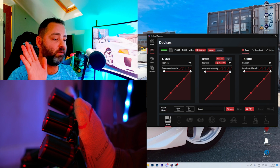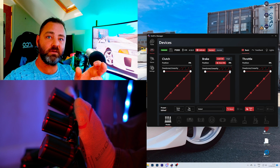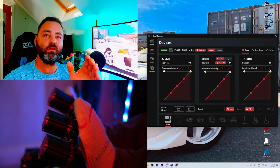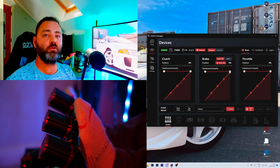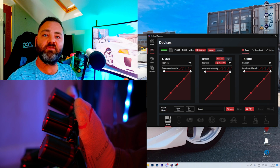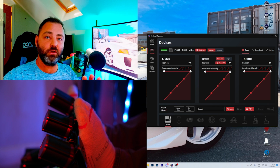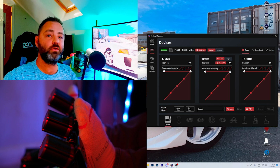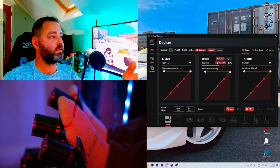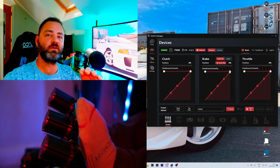I just know that when you're braking to your max brake pressure, the elastomers start to relax, and once they start to relax, that's when you get that little bit of bleed off on the brakes. Like I said, it's very normal for load cells that use elastomers to have between 5 and 10%. I would say 10% is even at the high end. However, 5, 6, 7% is very normal for you to brake to 80%. There we go. But you can see there, it is impossible for you to hold 80% on this brake pedal.